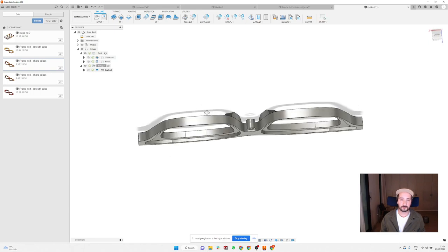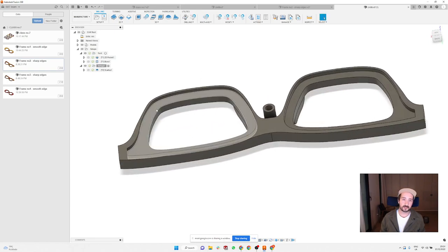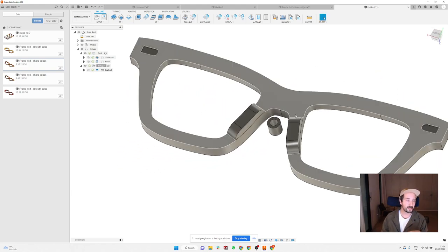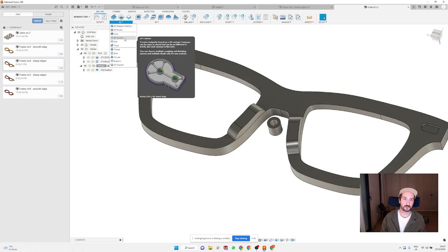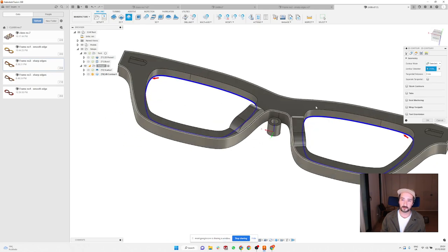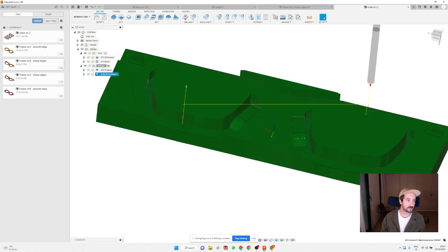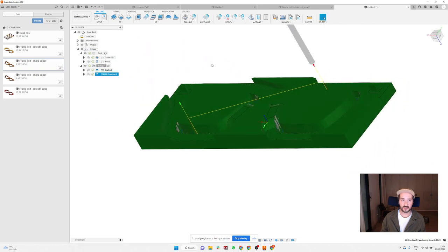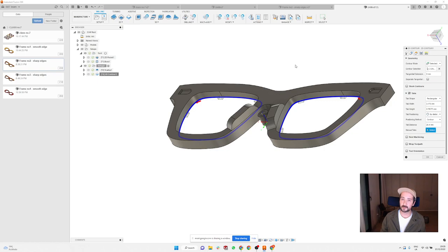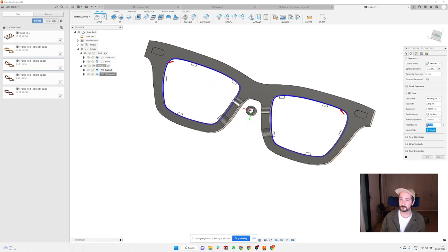Just one trick, because you're not going to cut the material all the way down: I would recommend, when you do the lenses, leave a few tabs there when you do the eyes, so it's still going to hold nicely in position. So you can use the 2D contour, and you're not going to click on the bottom here, so you're just going to cut towards your previous cutting, and that should be it. As usual, don't forget to not go more than, let's say, 3 millimeters deep, and put in a few tabs. Maybe this is slightly too excessive, so maybe something like this should be better.